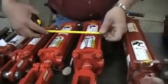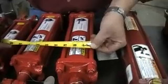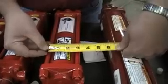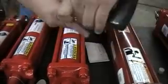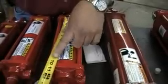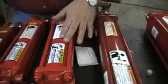This one is the three inch bore. We measure around the outer cage, getting the center of that rod to the center of that one — and as you see on the tape, you're getting to three inches. Then we measure the length of the barrel assembly and it measures 10 inches. We deduct the two inches and we know it's an eight inch stroke cylinder.